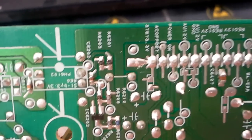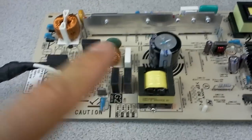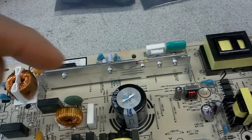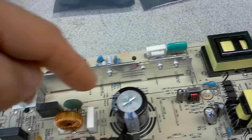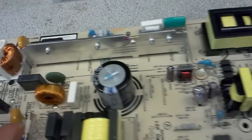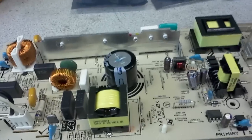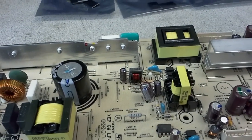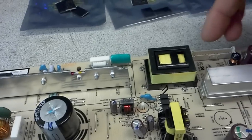And when that happens, the board should be turning on the rest of the voltages by basically energizing two things in a row. There's a power factor correction circuit here, which raises the input voltage on this transformer from 160 to about 380 to 400. This is a standard PFC, and then the driver for this transformer, which generates the rest of the output voltages, is also activated, and this 24 volts appears here.